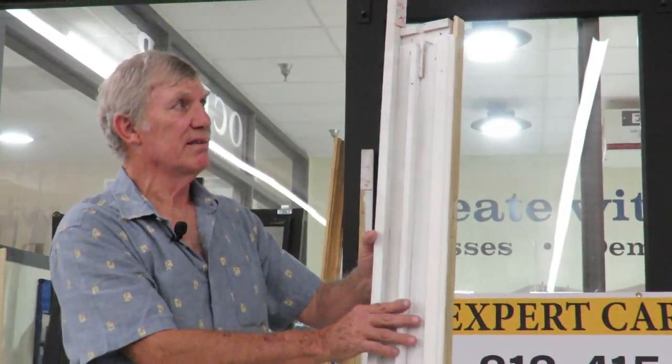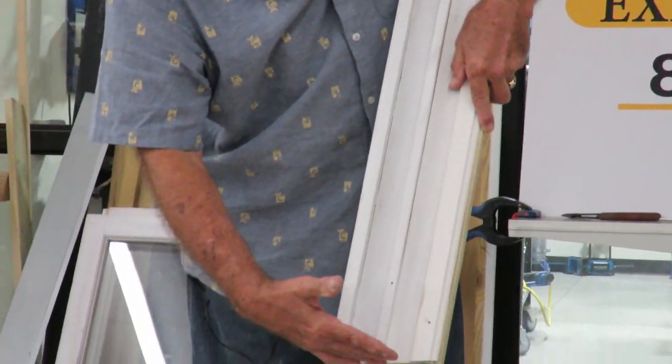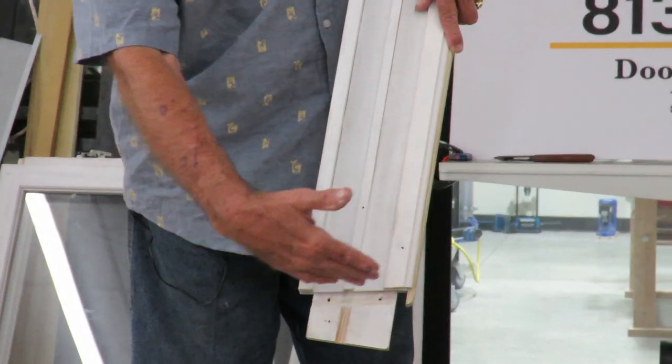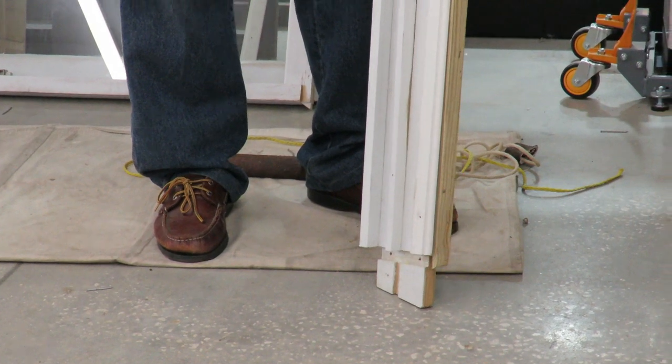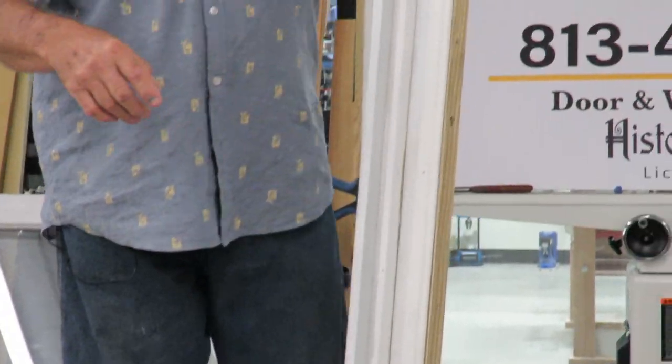As I said earlier, this is the jamb segment — no different from the piece I showed earlier. There's a deliberate slope of 10 degrees on the bottom. The head jamb fits in to house those sashes to the dimension required for them to overlap in the middle. That's called a check rail — when your windows are in check, they're perfectly leveled off.